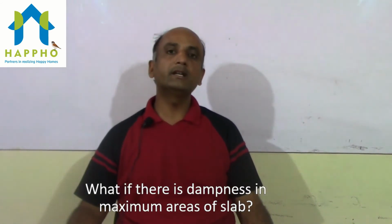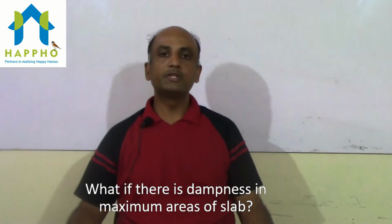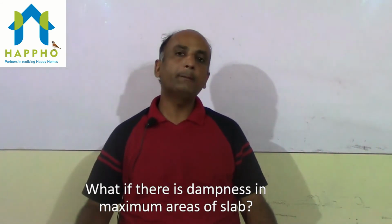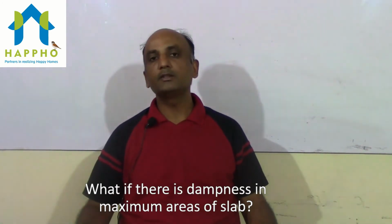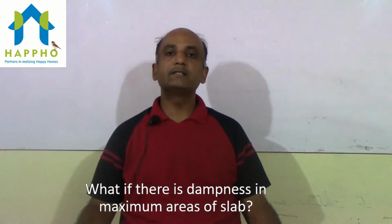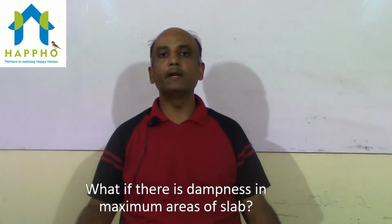Alternately, you can treat the slab bottom using PU grout, that is polyurethane grout. To do the PU grouting, first you need to identify the damp patches. Through the damp patches, you have to do the PU grout. Basically, PU grout decreases the porosity and increases the impermeability of the top slab.